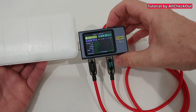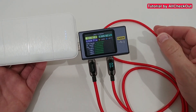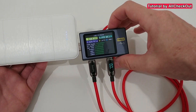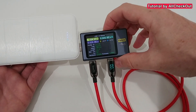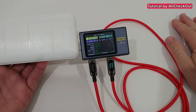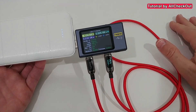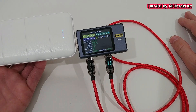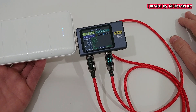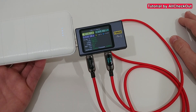I don't know if there's more information. When we push down here, you can see some other things, but I have no clue what this item is. When we push again, it goes back to the first page. Going left and right doesn't show more information. Someone asked me if it's PD 3.0 or what — it looks like there is no information about PD, so I guess PD is just a software thing which is not built into the eMarker, but I could be wrong.